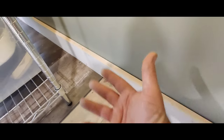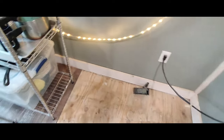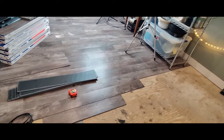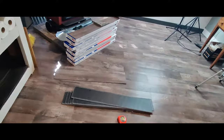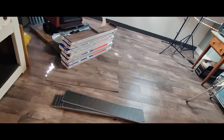In my place, on this wall, there are a couple parts where I couldn't slide it underneath, and I just butted up against it. Is that the right way to do it? Not really. If you want to do it professionally, you want to make sure your floor angles underneath your baseboards. But it's not a big deal — it depends what you can live with. I also like a project like this because if you're on a limited budget, you can go get two boxes at a time, lay two boxes, or just start hoarding it. Just get it as you can get it.